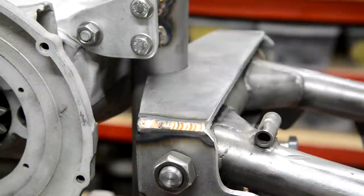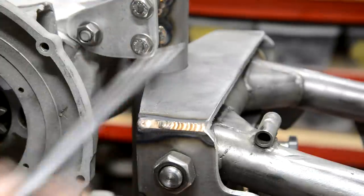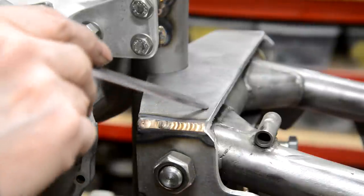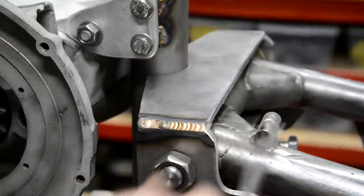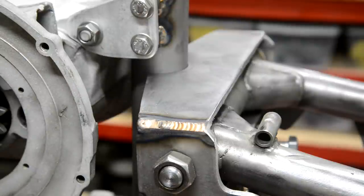Now you have to bear with me here, because sometimes I say I'm going to weld this, just like you say a vacuum cleaner's a Hoover. So I'm planning to bronze all this up, but you'll see. So bronze that. I actually cut a quarter inch off that and just fared it in, just to make absolutely certain that would come up. I left the bottom as it was because, you know, we're nice and clear down there. There's no problem.